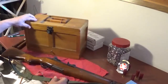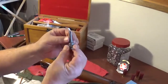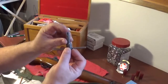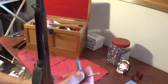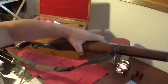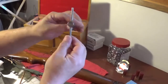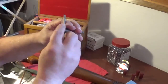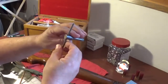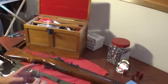Improvised tools. I made this out of a number two impact Phillips insert. I just ground the end off and kind of doctored it up a little bit. It fits the gas plug exactly. So when you want to take the gas plug out, you just crack her loose - this is real handy. You take a section of M16 cleaning rod - you can get those cleaning kits for like three bucks - and it fits through that hole perfectly. You might have to take a round file and doctor it up a bit. Press it on through and that's it. I use a little bit of Acraglas to hold it in place. I've had that for years and made a bunch for my buddies. It works great.